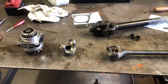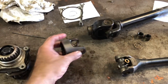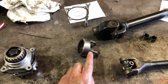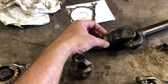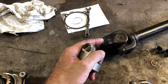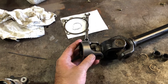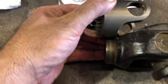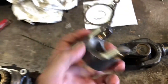Just one more quick rundown. Took this off. This will now become this. So the ears will be machined off and the ID of this will be opened up to accept this yoke. And then we're going to probably put a key or something to help it from spinning, and then TIG weld it completely solid. That way, this just becomes one piece, just like this. I'm pretty pumped about this idea.